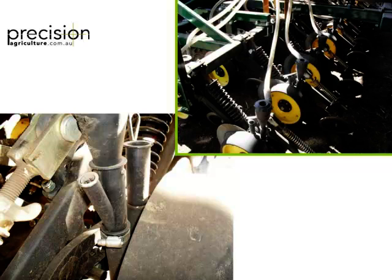You can see you can get a number of shooting options here down the bottom, but obviously still, again, you've got to be very careful with nitrogen. You don't want to put too much nitrogen down the seed. But seeing people using single discs just for inter-row banding, that's becoming popular.